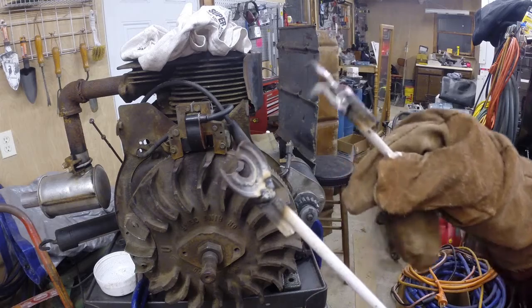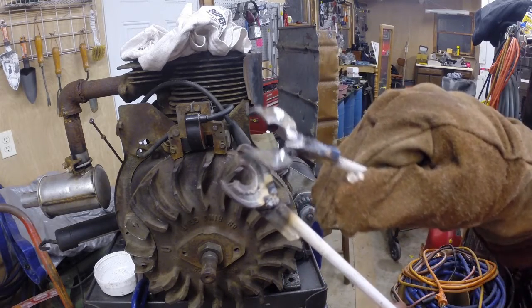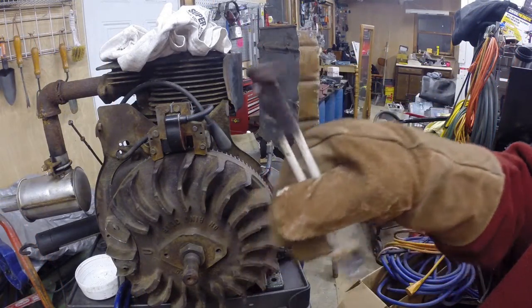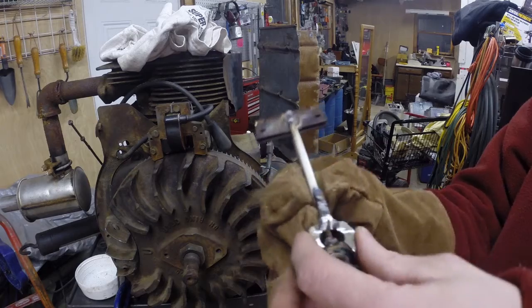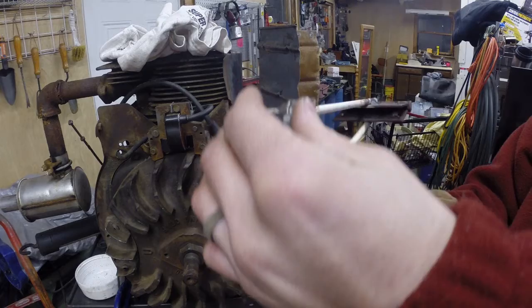Here's after I made my cut — it's not very straight, but I'm going to take it over on the grinder and straighten it up. This is after I welded the hinge on, so it goes down and up like that. Now I just need to make a mechanism that will hold it as it goes up and down.